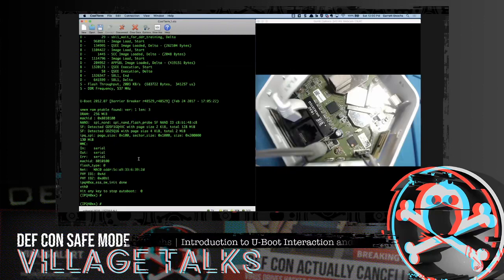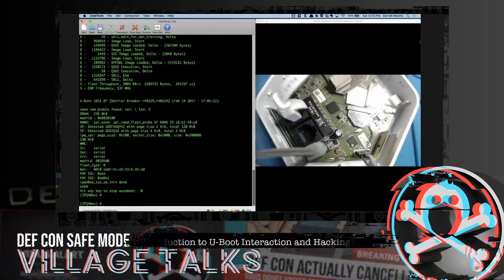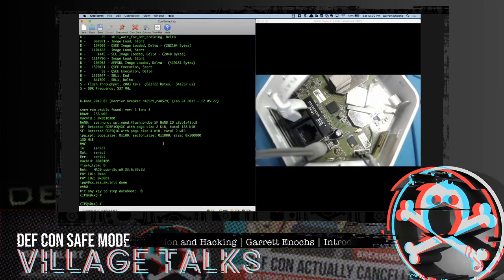But once you compile it with the complete device tree, then, as he showed with proc MTD, which is the memory technology devices, kind of an abstract layer between the hardware, the physical flash hardware, and the other part, you can potentially mount those file systems, or you can also DD them off by calling them directly through dev MTD 0 through 9 or 10. It's really easy once you get some kind of console, which would be the ultimate goal of bringing in a new kernel via TFTP, because it would have the device tree, and you would see the chips. Even though they're not mounted, you can easily DD all of those images off, the root file system and everything, from a separate booted kernel like this, giving you the ability to do some offline binwalk and extract the data, hopefully finding the root.